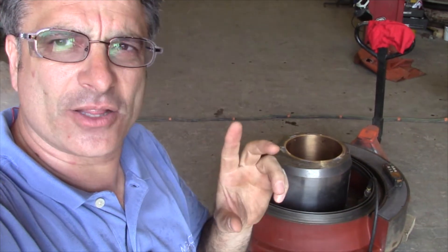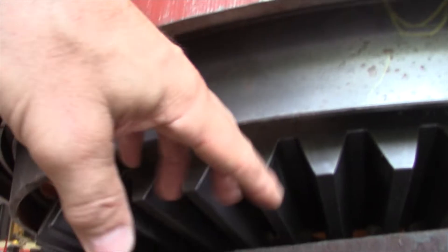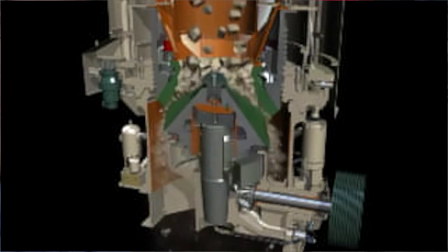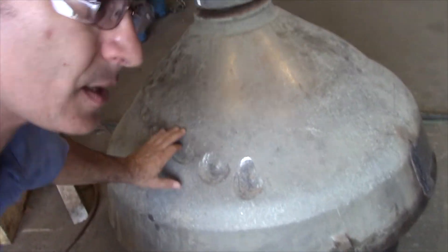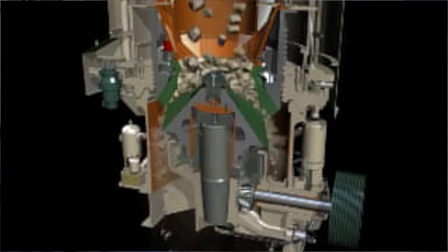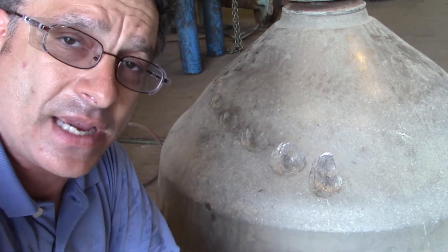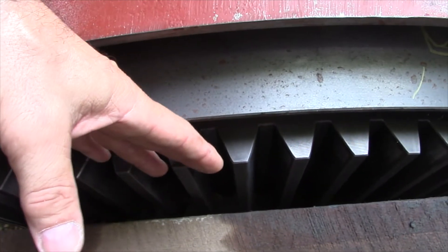The connection is down here at these teeth. This part is made to rotate, driven by the counter shaft, which in turn is driven by a motor. But if you experience a tramp event like the one you see over here, the entire machine comes to a complete standstill — and it's quite a shock load to the crusher. So if this happens to your crusher, there's a definite possibility that not only do the brass bushings get damaged and side loaded, but you could also break off your counter shaft and the drive ring. It's very easy to knock off a couple of teeth.